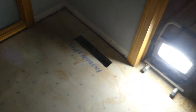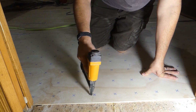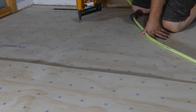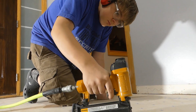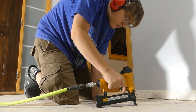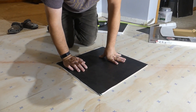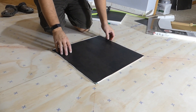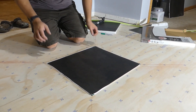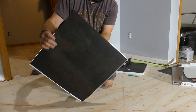Now it works. You have to lay the first tile, and then everything else gets laid off of it. Does it have like a sticky back? Yeah, it's got a vinyl sticky back, same as the tile that came out. And then you use spacers and you grout it. This stuff is super sticky. Can I touch it? No, you can touch the scrap later.